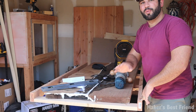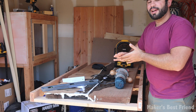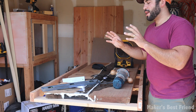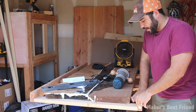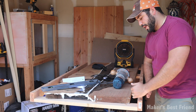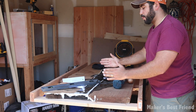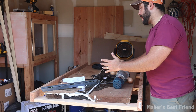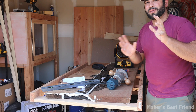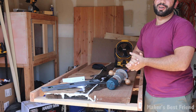At this point you could actually be done — the slab is now level, and you could just take some MDF, plywood, or whatever is really flat and create just one piece of wood across it and use the router on top. That's a quick and dirty solution. I'm going to take some MDF and make a proper sled, raised a little higher than the base because I made this a bit too close for comfort. I'll have it riding on the sides with supports, and create a surface in the middle with borders so the router stays within a set range. I want to make it nice and strong.